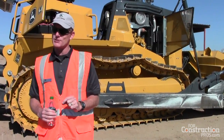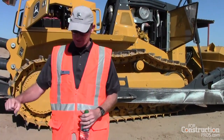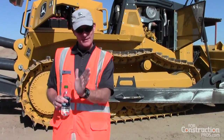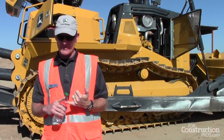The hydrostatic transmission also allows you the ability to counter-rotate on the go. We demonstrate it by taking the dozer out to the middle of the operating area — the operator takes the steering lever, does a counter-rotate, and you just watch the machine turn on a dime. But that's not where the counter-rotating feature really comes into play. If you're pioneering a road and cutting up a slope, the slope is going to try to pull the machine into it, and a lot of times you'll see an operator back up, reposition, and then get back into the cut. With the counter-rotating feature on the go, you can just correct that machine and keep your line going.